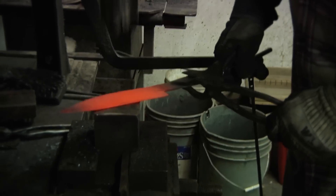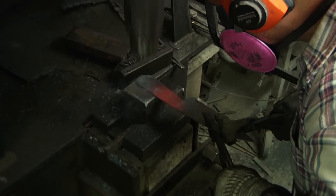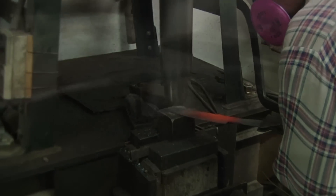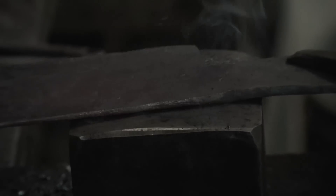As I'm cleaning up and doing the final adjustments to the thickness of the tang and the thickness of the blade, I'll be forging at a bright red heat. And then as I'm annealing, I'll heat at a low red or a dull cherry red heat.